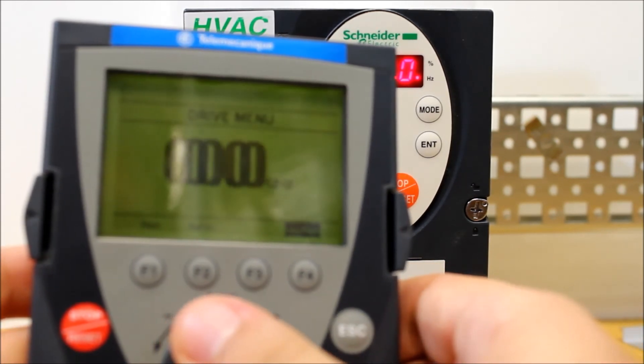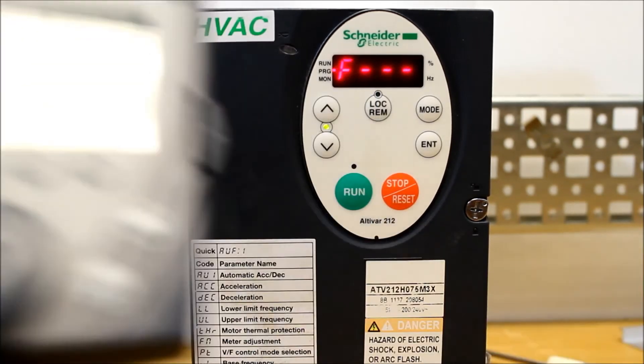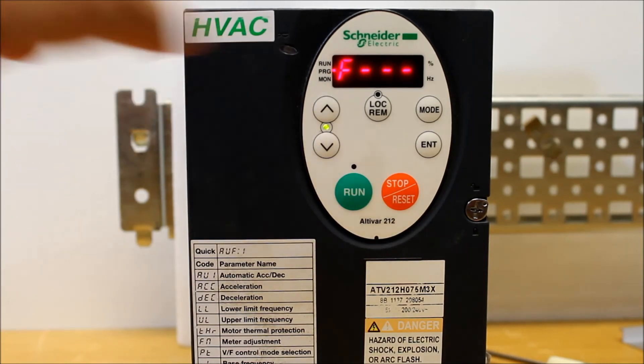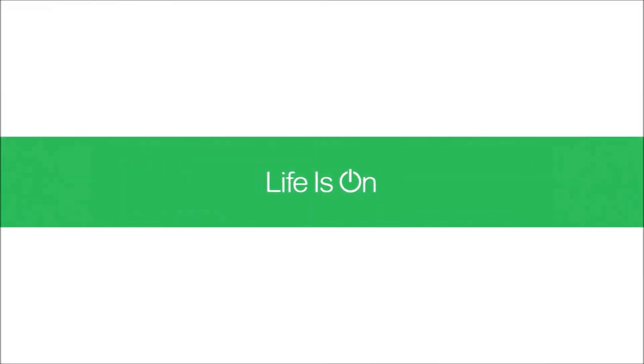You can enter and go into whatever menu you like and go from there. This explains how to combat the connection in progress issue on the ATV212 drives with the keypad VW3A1101, and how to set the baud rate back using the main display of the drive to where it needs to be, which is 19200 for parameter F800. Thank you.